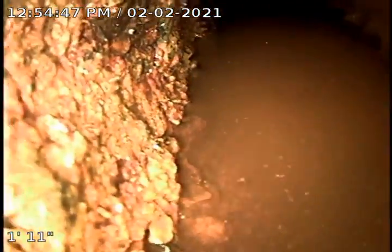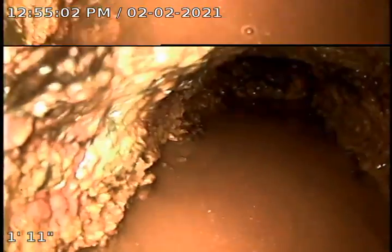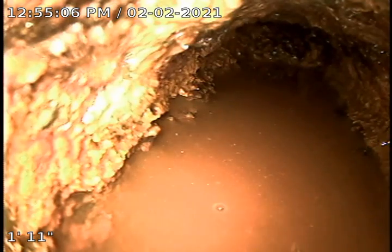We're down here in the floor drain now, and there's a blockage pretty close, right in here. Can't get very much further than that. See how, if I pull this back a little, the pipe is obstructed there. And we got some standing water. This is just a few feet in. Floor drain, see here. And the clean out.